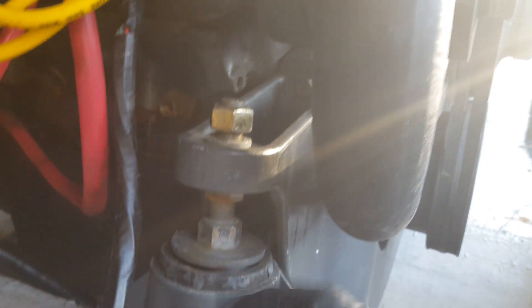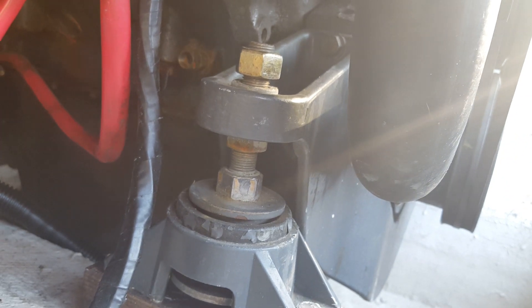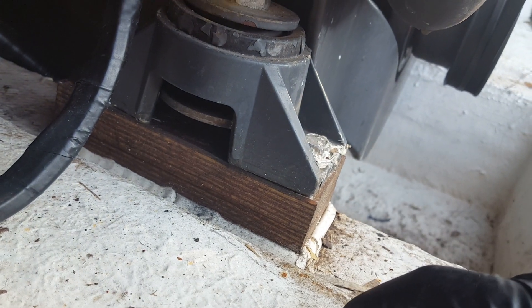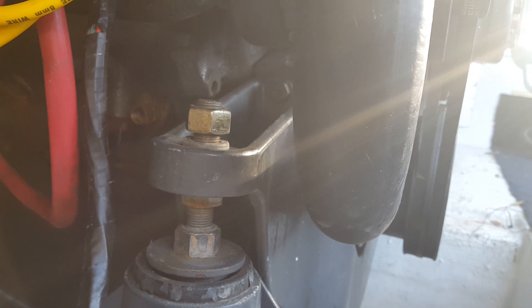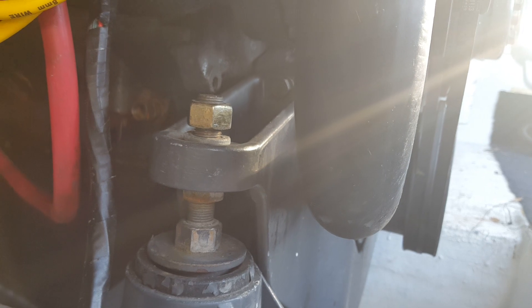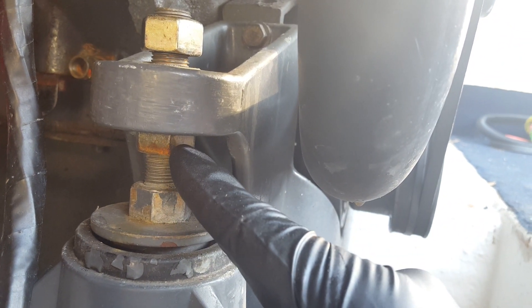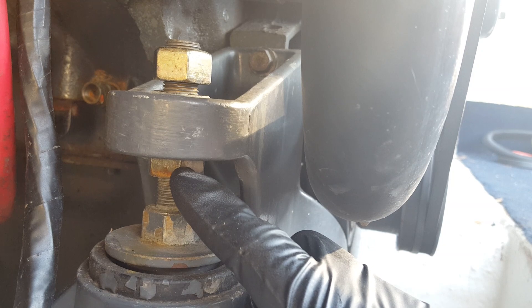The big question is which way do we turn the nut — are we jacking the engine up or down? There's a lot of wood in here and wood settles. This engine is heavy and we've been bouncing on waves, so 99% of the time you're going to need to move your engine back up. Whatever you do on the left side, do the same on the other side — equal turns, just like algebra.